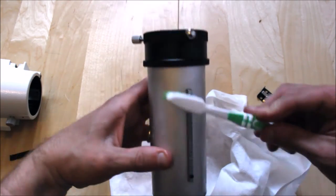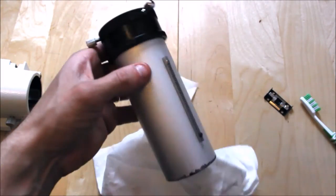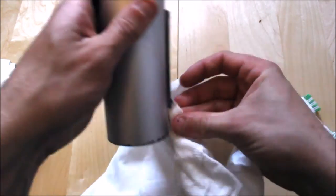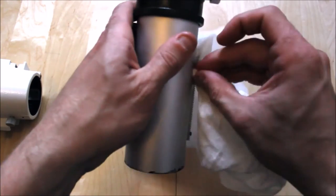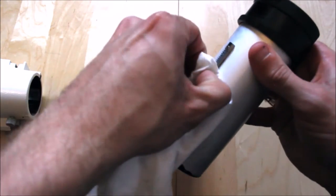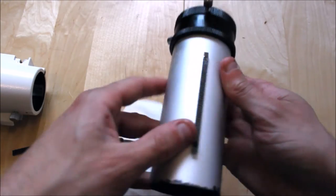Because the grease is very tough, using gentle strokes along the gear itself — just brush off the old grease. You will get this grease removed. Just keep brushing it, then clean up with your rag. Keep doing it, spray some more WD-40 or alcohol. Depending on the type of grease you're trying to remove, it will get it off — it's a lot easier with WD-40 because it softens that grease.